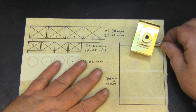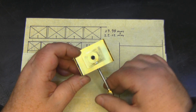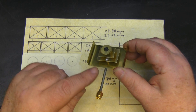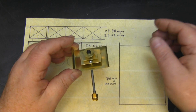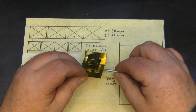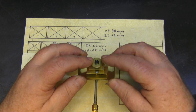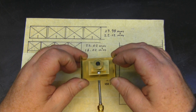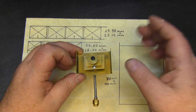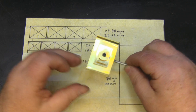The one we're going to build in this video is a quad package of one of these. Basically we're going to take the elements of this and multiply it by four, and hopefully we'll come out with a directional antenna that has around 15dB of gain. This one's got about eight — it'd be really nice if you could build four of these and have 8dB times four, but unfortunately it doesn't work like that.